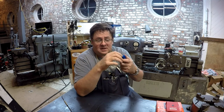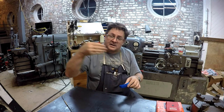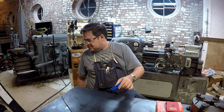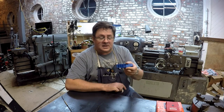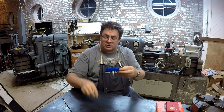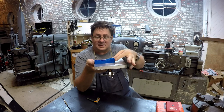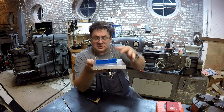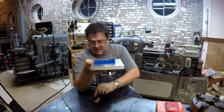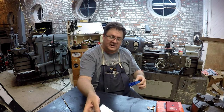Why can't I just size this one up or make the hole bigger? One of the problems is the way the pocket drills into the wood. Since this screw is so much larger and will be attaching with so much force, I want more meat between the screw head and the end of the board. With a regular pocket drill guide it's about three quarters of an inch — I'm looking for at least an inch and a quarter, which should be sufficient.